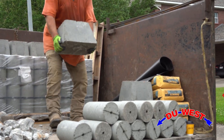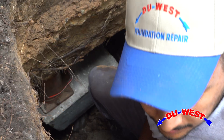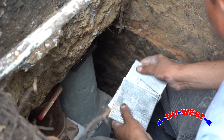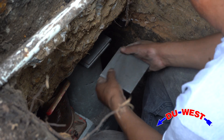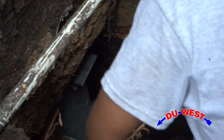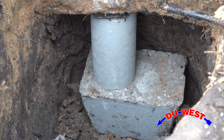Now this is a pile cap. After the pile is driven, you set the pile cap on top, put a jack on one side, a cylinder on the other side, and pressure it up and then shim it off. You've got to keep the pressure on the piling the whole time, otherwise it'll try to spring up out of the ground. Once that's done, you're ready to move on to the next hole.